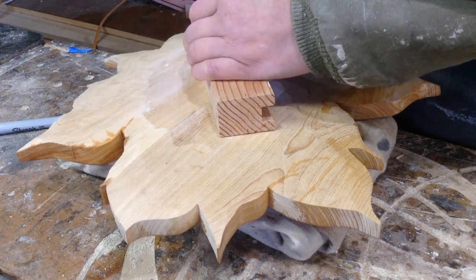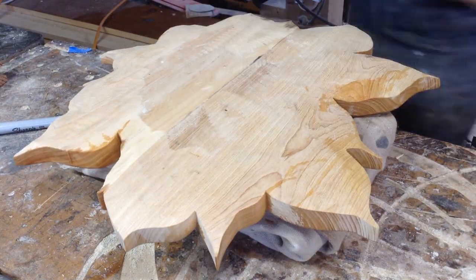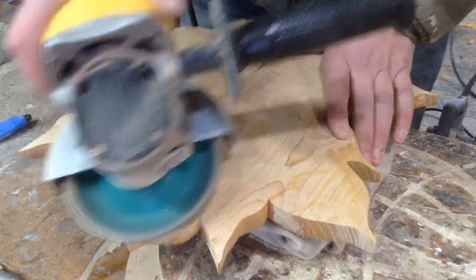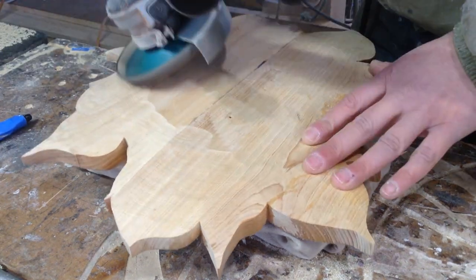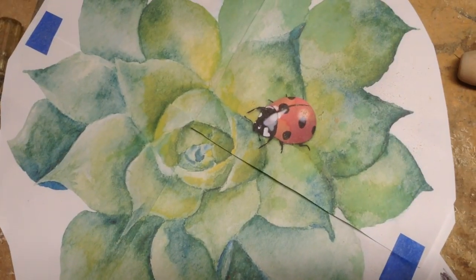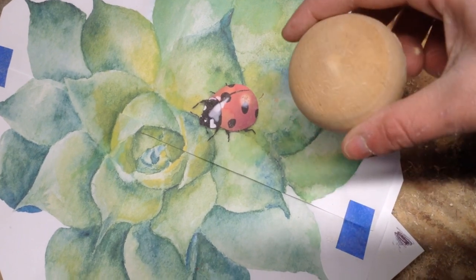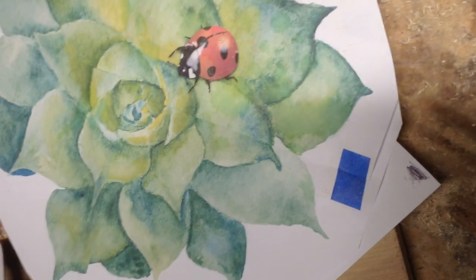At this point I could take my cleat off the back and I'm just going to taper these edges a little bit more, make them a little thinner. I didn't do this initially because I realized quite quickly that the tips of these leaves are quite fragile, especially the ones that don't run with the grain. So I waited till the end - I didn't want them too thin while I was chiseling and have them keep breaking off.